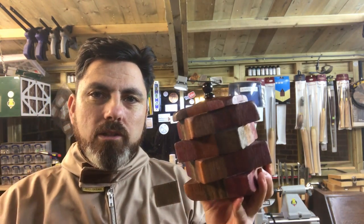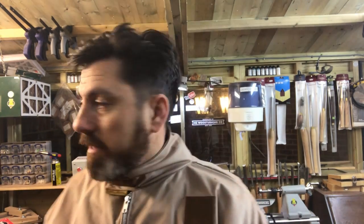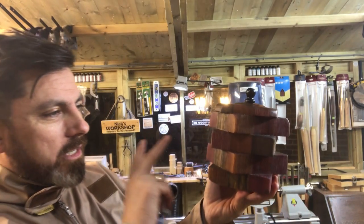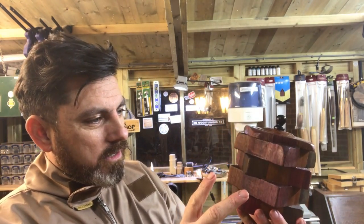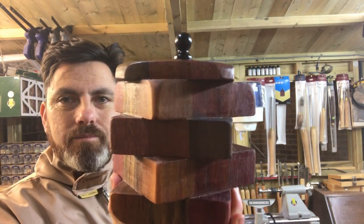If you saw earlier on, I did try and use some acrylic spray. Is it acrylic spray? Sorry, like a lacquer. I did try and spray some lacquer on it, but it didn't really come up very nice. I didn't like it, so I spent another hour rubbing it all down again, and just applying the boiled linseed oil on there. I think that's good enough finish. It's got just a natural sort of matte finish on it now. So there it is.